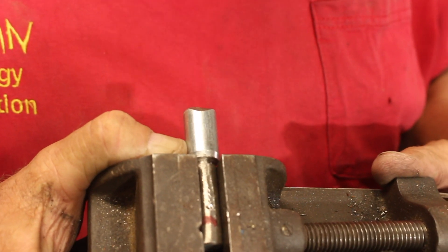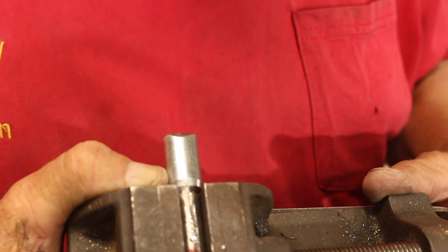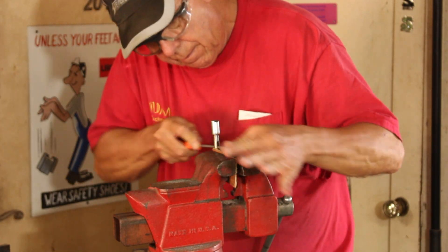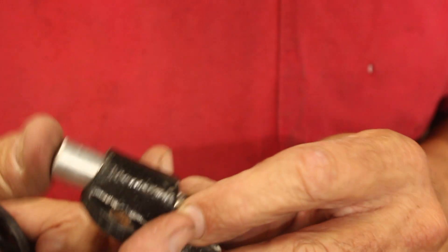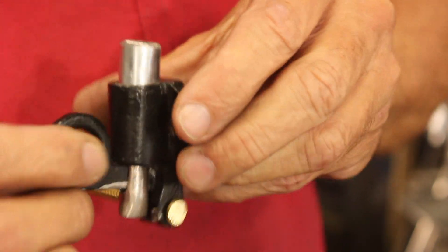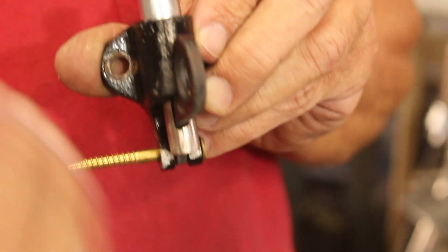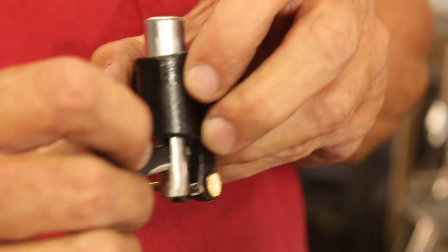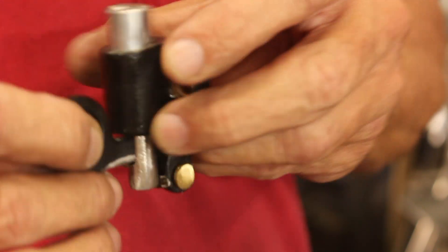I've center punched for four very small pilot holes. I'm going to drill those and then connect them together by enlarging them. Here's our replacement bolt — let's put this thing together. Here it is completely back together and it is working. I'm going to cut that screw off and peen it over, and this will be done. Now I just have to build two more of these bodies.